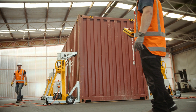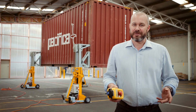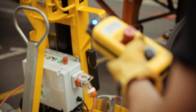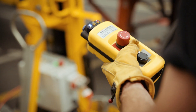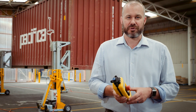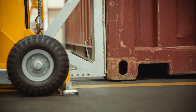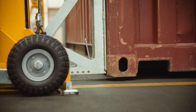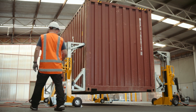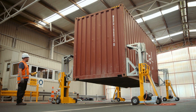The process is basically the same whether the container is on the ground or up on a chassis. Once you've set the Sealift up it's as simple as powering it on, doing some basic safety checks, then lifting and lowering the container using the wireless remote control. The remote is really simple with just three buttons: emergency stop, up and down. The control system senses the load and available electric current to optimize the speed of your lift, so if you have an empty container and a good electric supply, you'll hear the pump and motor speed up after about 10 seconds.